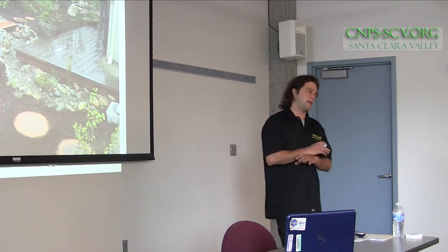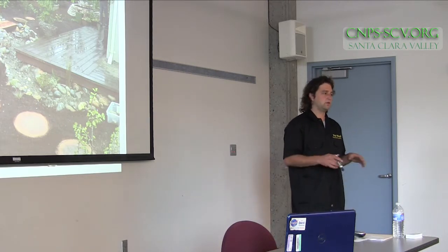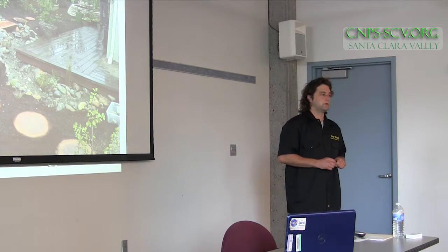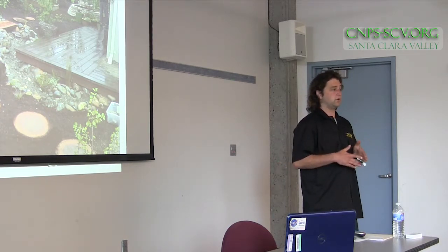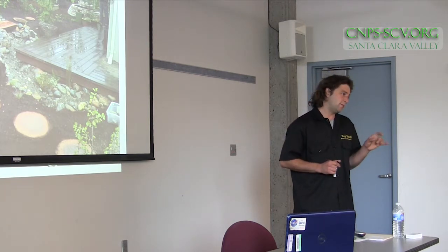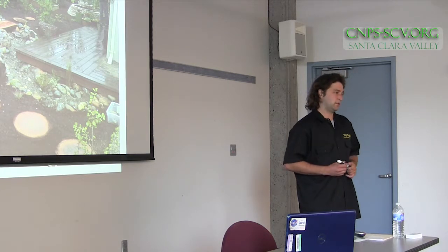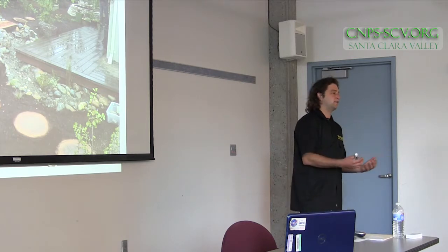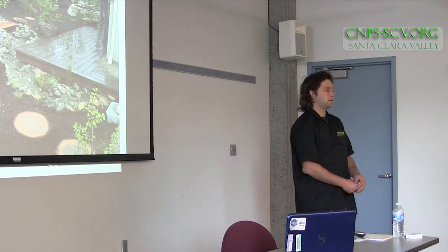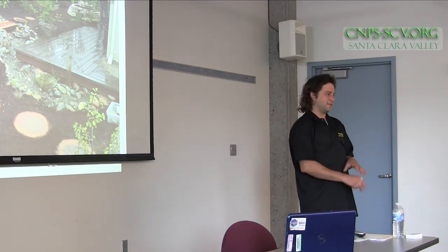If you're concerned about it, just don't have any mulch at all, right? That's true for your house. Don't water it and don't have any mulch. You mean besides the 18 inches, another 8 inches? I'm sorry, 18 inches of no planting area and no mulch. You can plant stuff there, but if you are going to plant anything there, have it be something that isn't really woody. So maybe things like heuchera, maybe a fern or two, something that's not going to attract a lot of decomposers. If you have some really big woody shrub that gets water all the time, and it's nice and shady, you're basically creating termite habitat.